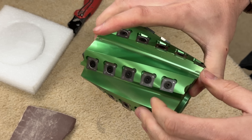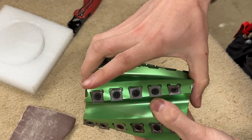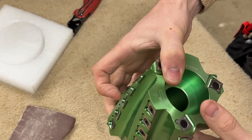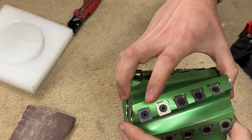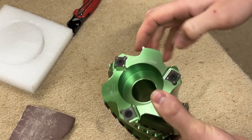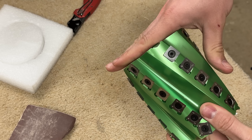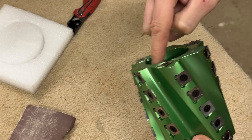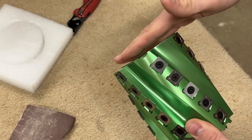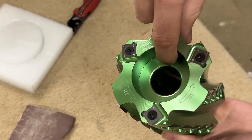What I wanted from this was a really tall spiral cutter block. These are the shear-style cutter inserts so they work on a shear cutting action — a lot less stressful on the spindle moulder and you get a much cleaner finish. I wanted a really tall cutter so I could do deep seal cuts, but I also wanted it so I could recess the top nut of the spindle moulder within the cutter block. I've done a few jobs lately where I needed a really deep 90-degree cut out of the back of something and the top nut always gets in the way, so I wanted to be able to recess that in and cut all the way flush over the top — almost like a tenon cutting disc.